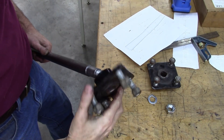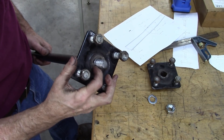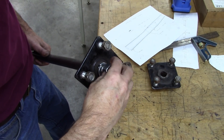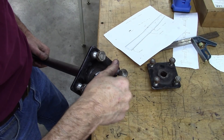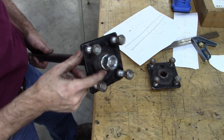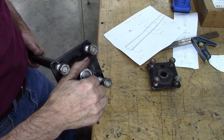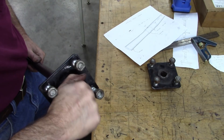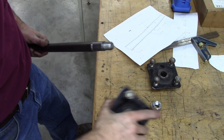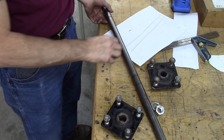Let's see how this goes together. It goes on there like that — the end of that shoulder right there is just slightly inside there, just like it needs to be. Locknut. After I lock that down the threads will be sticking out just a little bit. That's going to work out good. That about wraps it up. That's how you expand the capacity of your lathe using a steady rest. My next step will be to cut some keys in there. Thanks for joining me and be sure to subscribe.